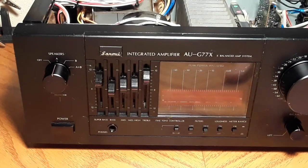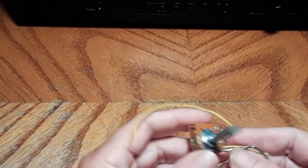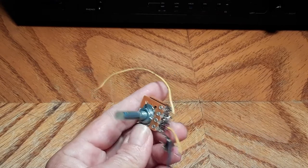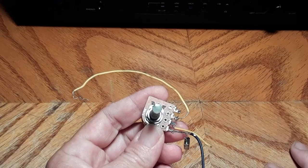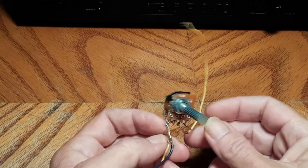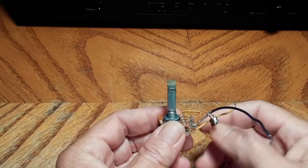Next problem: what do I do when the volume control is shot and I can't find a 150K pot for it? If you get yourself all stressed out, that's exactly what happens. So this is what I did. I've invested in these cheap little things, which aren't too cheap when you buy them, but they're very cheaply made. It's a 100K pot with a loudness tap on it — going to be way overpriced, but it's about the only option sometimes.